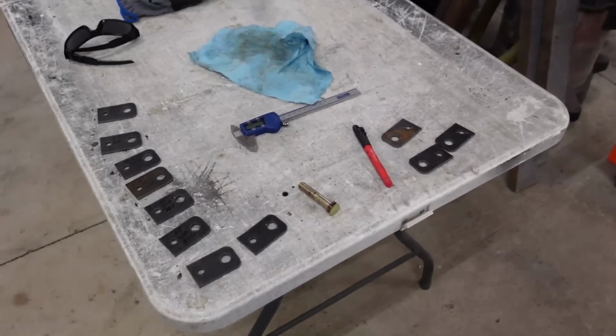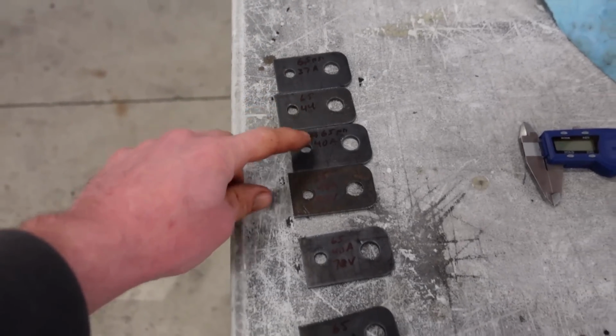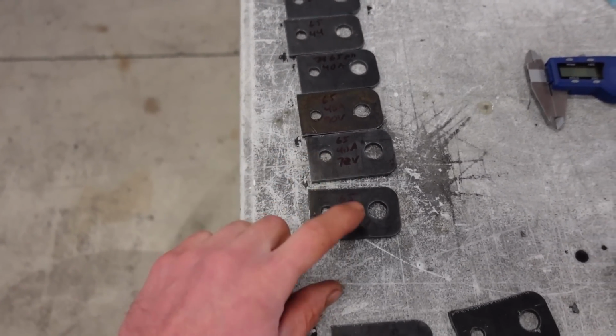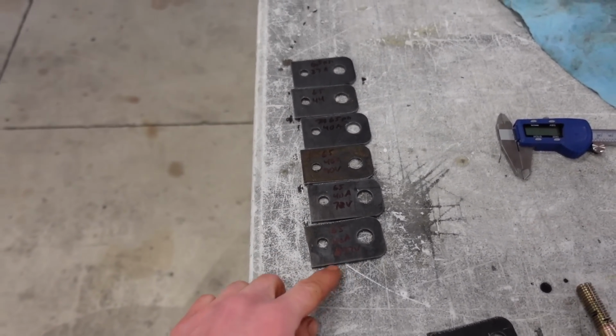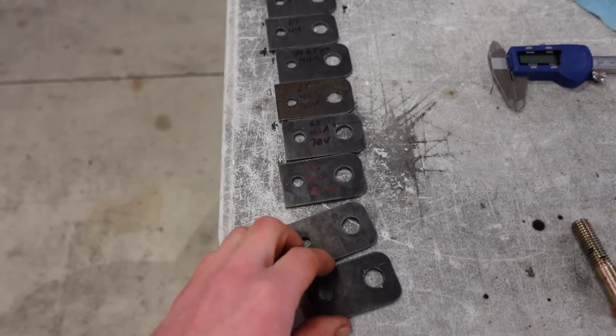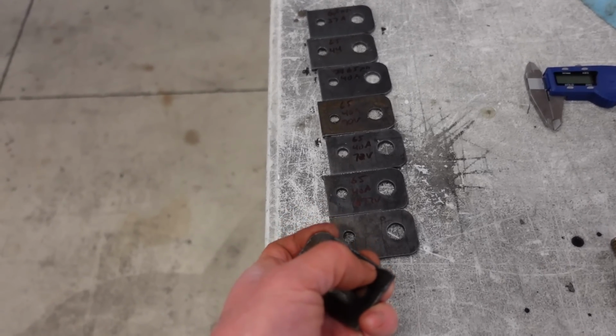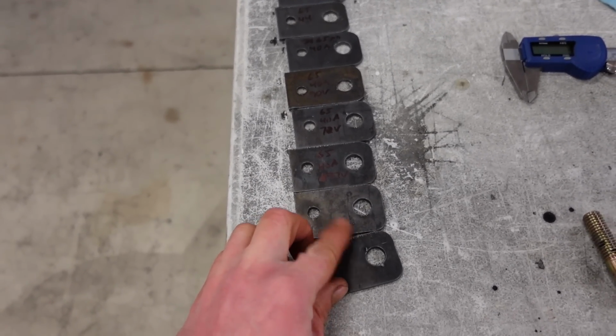All right, you can see I did a ton of testing. So I changed the pressures, the amperages, and then I started messing with the voltage for that nominal height for the torch height control. And I was just trying to get this dross under control, which I got very close. This stuff, like I said, picks off pretty quick with a fingernail or a screwdriver.